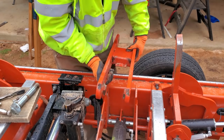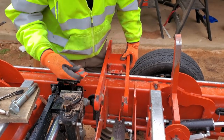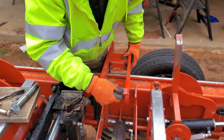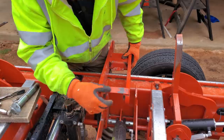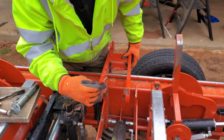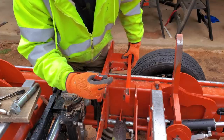So what I was looking at from the other side is right here. Okay, what I was trying to show you from the other side is this piece appears to go right there. Here we go. That weld did not hold. There was nothing even there. That never penetrated into this. So it was only held by that. And then this penetrated onto that, but not into this.